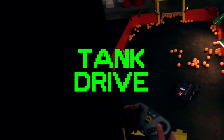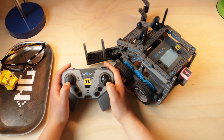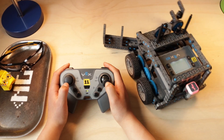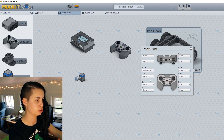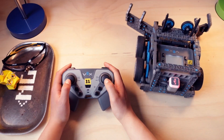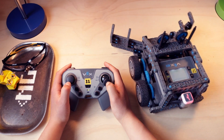The other driving style is tank drive. With tank drive, the left joystick controls forward and backward movement for the left side of your robot, and the right joystick controls the right side. Robot trainers generally consider this style more difficult to master, but it ultimately gives you more control. To code Dipsey for tank drive, make sure everything says none except the A channel — set to L or left drive — and the D channel — set to R or right drive. Whether you choose arcade or tank drive, you'll probably want to test out both.